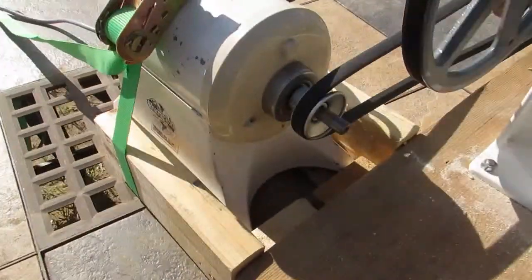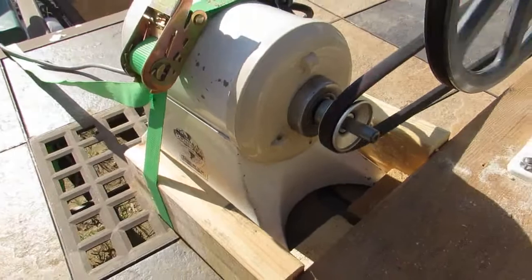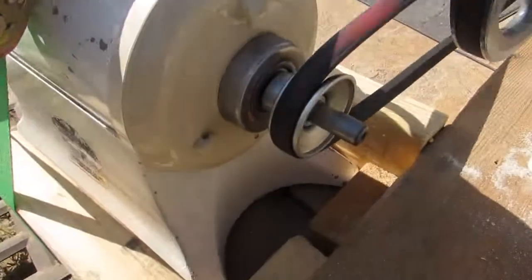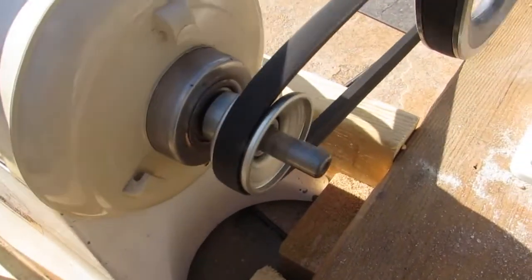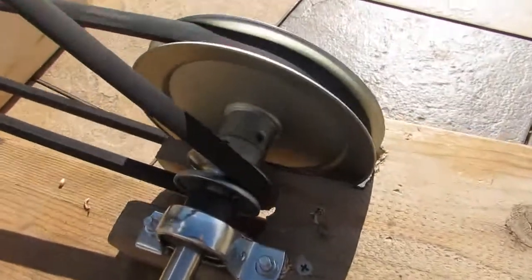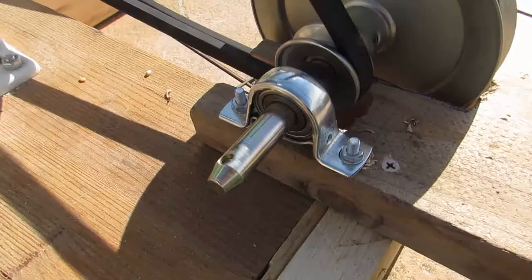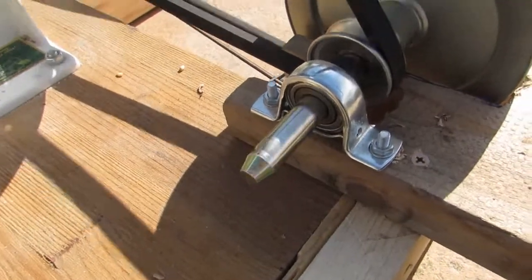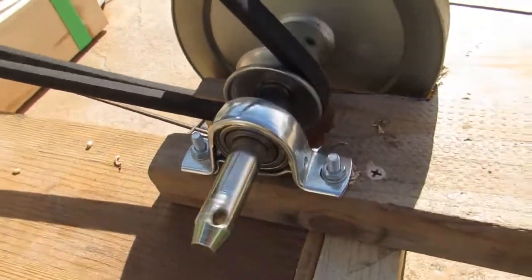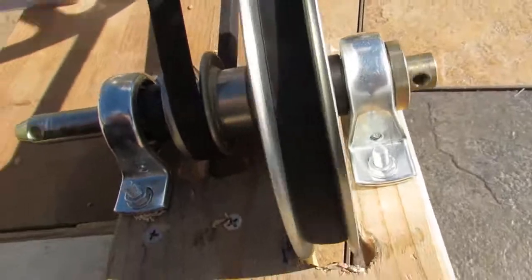The particular motor I'm using is a Champion juicer that I picked up at a thrift store for a few dollars. It was missing the juicer insert piece, but that didn't matter since we didn't need that. As you can see, there's just a 2-inch pulley on there, with a 42-inch belt over to a 6-inch pulley, down to another 2-inch pulley. The drive shaft is actually a giant hitch pin, but I found it's exactly the right diameter, with some bearing pillows on either side.